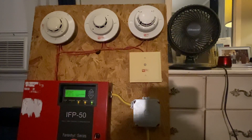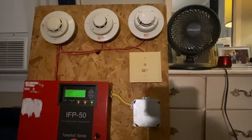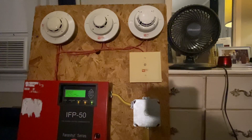When the fire alarm goes off, that relay opens the circuit, dropping power to the PAM relay, which then opens the hot wire going down to the receptacle, which will shut down the fan. You're not going to see a fan plugged into a receptacle — this is obviously set up for a demonstration. The relay is set for latching non-silenceable, so if the alarm goes off and you silence the alarm, that relay is still going to be tripped until you hit reset. Because if there's a fire, you don't want the fans running and giving more air and oxygen to the fire.